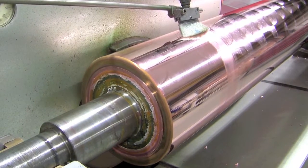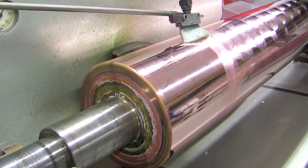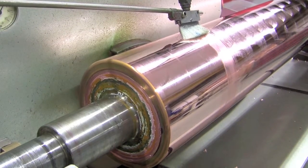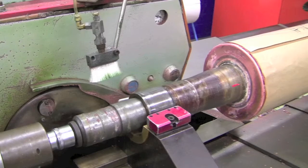Before looking at the Helio brushing process, let us have a short look at the current standard process of cylinder finishing. After the base copper galvanization, most cylinders are processed on a polish master, CFM or duo master to ensure the exact and consistent dimensions of the cylinder. While this process ensures the dimensions, the surface can get an undesirable pattern resulting from the frequency of the machining.